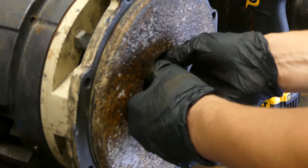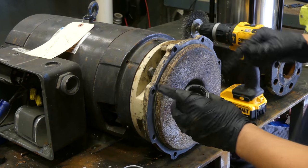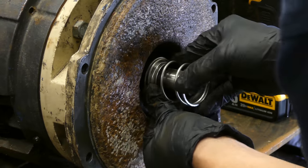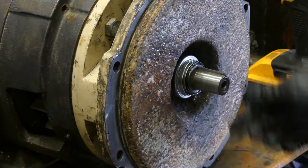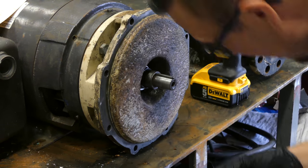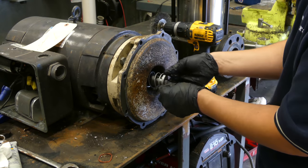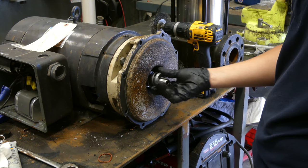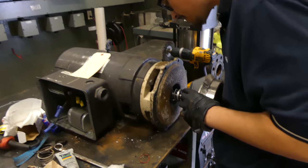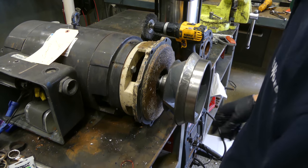It's a little snug so I'm just going to put a tiny bit of lubrication in there. It looks like we're flush. We'll put our spring in, cap on, and then when we get the impeller on there, that's going to compress it the rest of the way and it should seat really nicely — just like so.